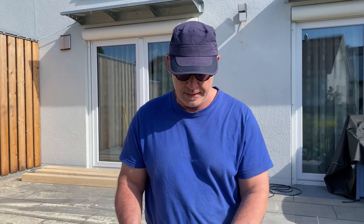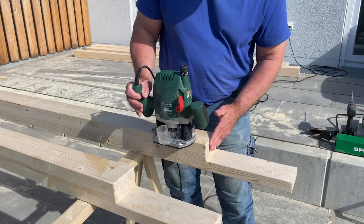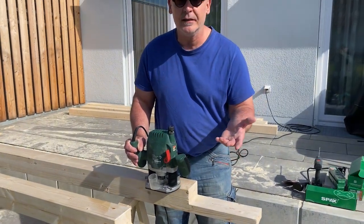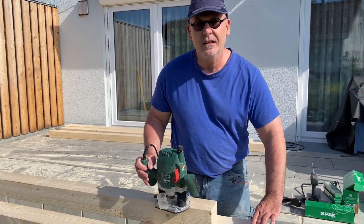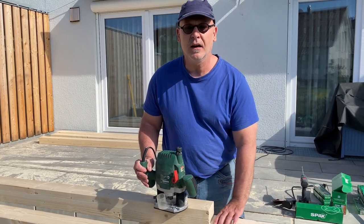Day 2 - you can tell by the cap, not just as a marker for day two but because it's really very hot. I prepared the posts. At the front there are two posts that I fix on the L-stones. Preparation means: notched, 60mm cut away - that will be the bearing surface at the bottom. This front lug I need to fix everything in the L-shape. As I announced at the beginning, the eye always works along too - so I decided to transfer the chamfer of the Brettschichtholz beams to my cut edges, so there's a clean edge everywhere. I think that looks best.